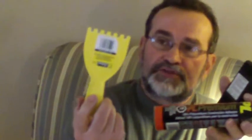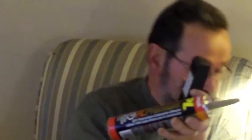The other equipment that I used to put this hearth together would be a stud finder. It could be picked up at your local Rona store for under 20 bucks. Your PL Premium glue adhesive to hold the wood materials together. Your basic finishing nails, and for the glue on the walls, I picked up a 1/8 inch notched trowel to apply the materials for the drywall. And then to set the finishing nails, a good hammer that you're comfortable handling, and a nail set punch. Those are basically the requirements for the materials or the equipment that I used to put this hearth together.